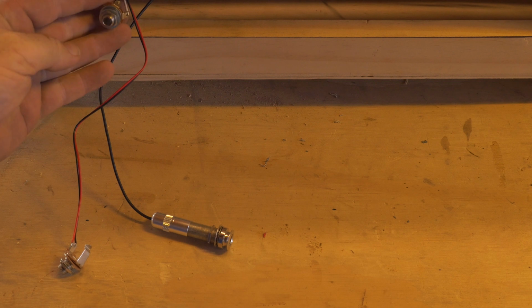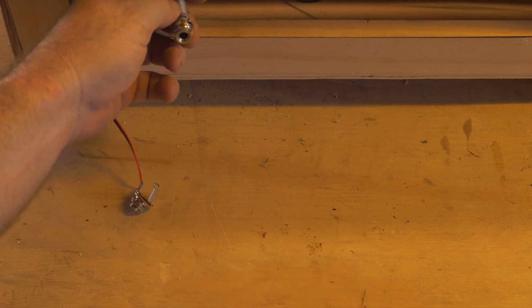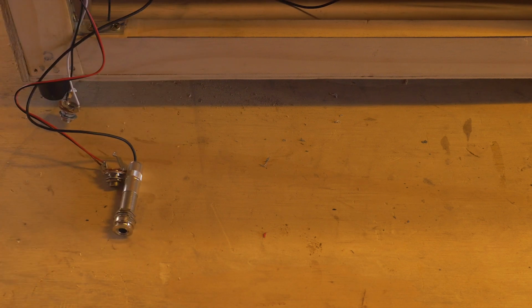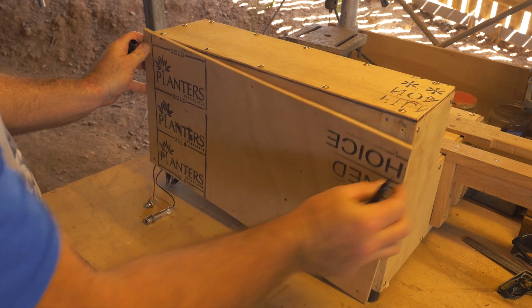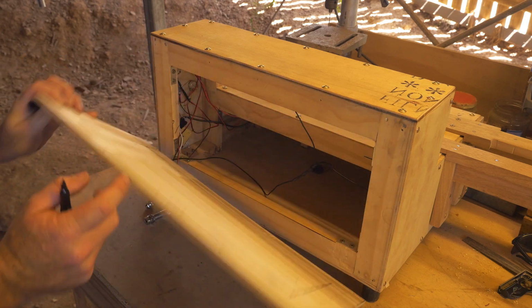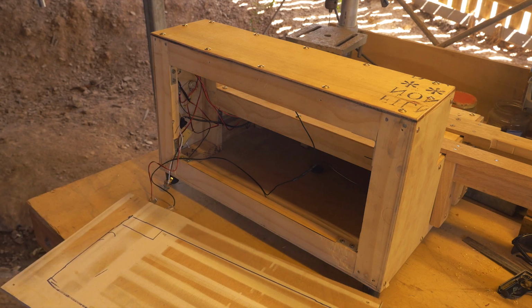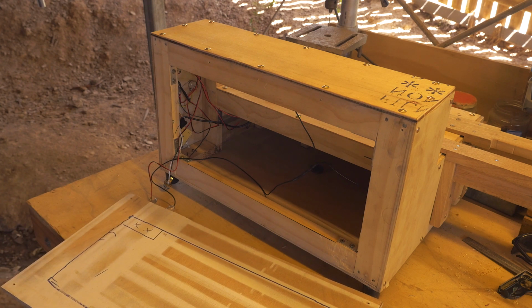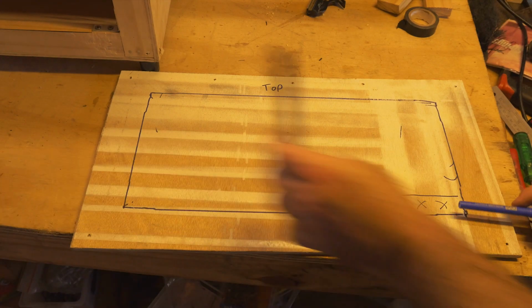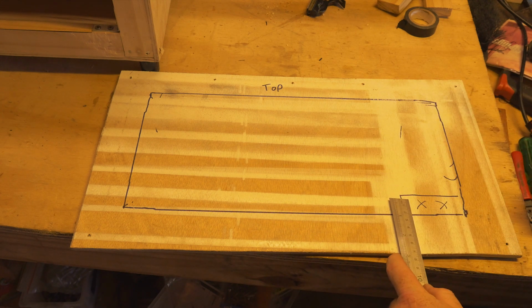Now, what I've got here, this is the back of the soundboard. We've got our 1/4 jacks from our humbucker, as well as our other piezo pickups, as well as the one I've just installed. So next, we're going to get the back part of our wood, obviously the back of the Apprehension engine, and where we've drawn the line, I'm going to work out where I want to put those 1/4 jacks into the back. So I'm just going to put a mark on the back of it. I've turned it in there and I've sort of got an idea of where I want them. So now I just need to make the associated marks to make sure that I get those measurements correct.